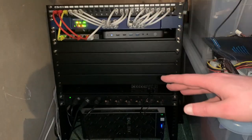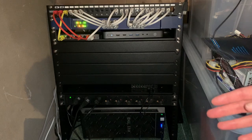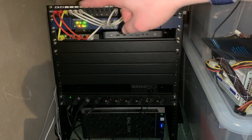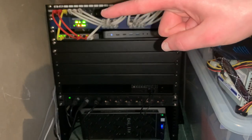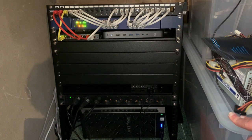A little bit of backstory: when we bought the house the only two connections available were either cable internet or DSL. The main cable provider was too expensive, so we went with DSL. The main point of entry for that connection was in the living room. The right red wire in port number two is the main feed for the living room — that's where the modem used to be. I still need to replace that with a white cable, because it's no longer an internet feed; it just goes down to the living room into a switch connecting the IPTV box and game consoles. The other one goes down to the utility closet, where the NAS is located, another switch, and the fiber optic connection is terminated there.